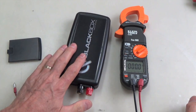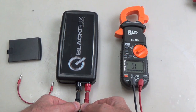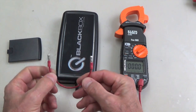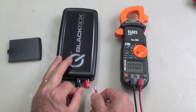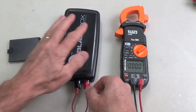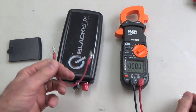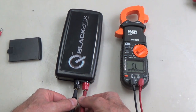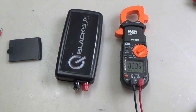Also, never try to short this thing out with the batteries inside — you'll get smoke, fire, and explosions. But with just the cells you can. To demonstrate: it's live at 18 volts. I'm going to short it out — bam, totally shorted. No heat, no smoke, no fire, nothing. Just like the micro generator cells, you can short them and leave it, and it'll come back. Already at 17.44V and in another minute it'll be back to 18.